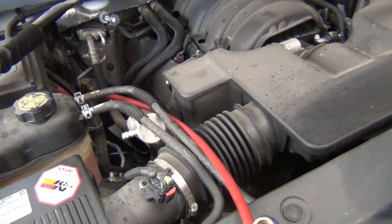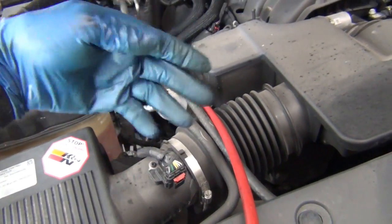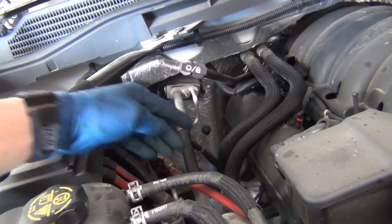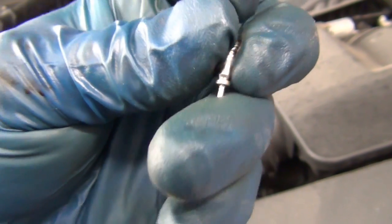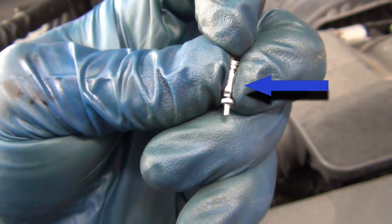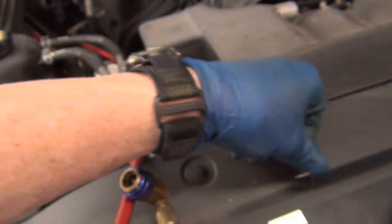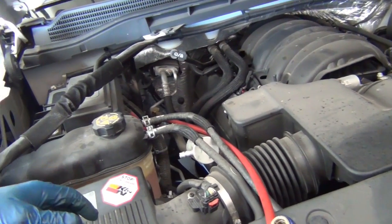Once you're past that saturation point and you recharge without evacuating, you're vulnerable — you've got moisture in the system that can cause the compressor to fail and chew itself up. Once that happens, you've got aluminum particles reaching the expansion valve. See that tiny little movement — it opens just a teeny tiny bit. When I put this one in, it held at first, but as soon as I did a test by pushing on it, the aluminum got stuck in there and jammed it so it wouldn't close anymore.